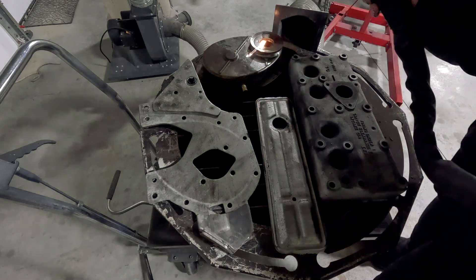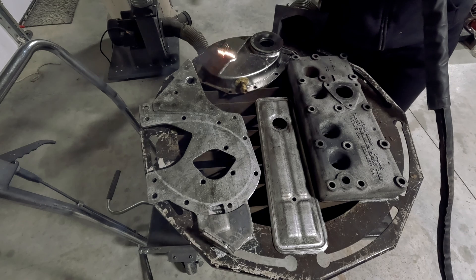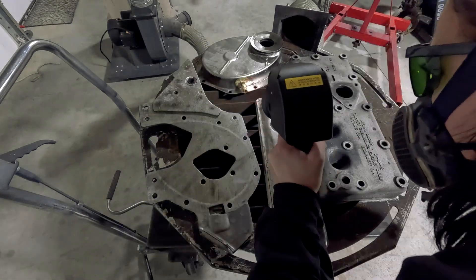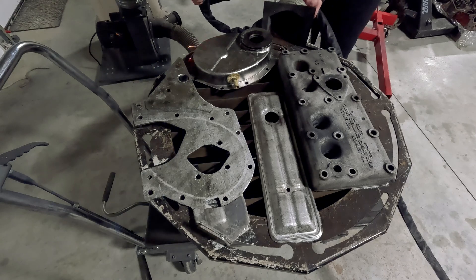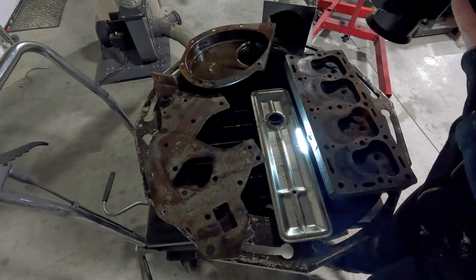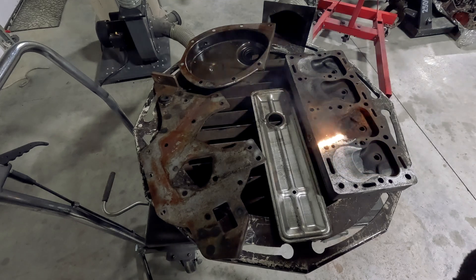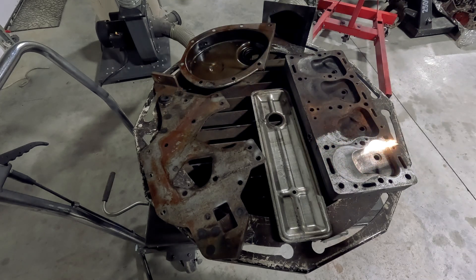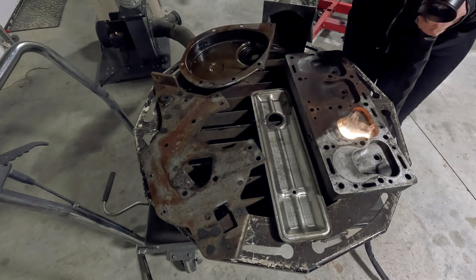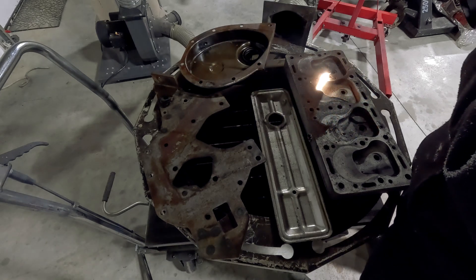The other thing you need to do is make sure you're wearing a good quality mask. All this rust and grease and dirt has to go somewhere — yes, it is vaporized, but that's kind of the point. It just puts it into the atmosphere and you can breathe that in. We realized early on that dust extraction and fume extraction are going to be a big deal for this. We're going to buy proper ventilation for the shop so we can run this and have everything venting outside, because sometimes when you're taking off the really thick greasy stuff you can get a lot of smoke. If you're working with vintage stuff, think about how much of this could have lead in the paint, or asbestos, or other hazardous chemicals — so make sure you're wearing a really good quality mask and not taking any chances with your health.